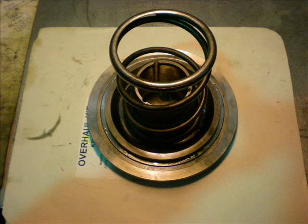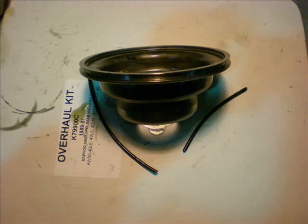Unfortunately, moveable cone seals cannot be replaced as the outer cup is seamed, so it is not detachable. Of course, you can try on a lathe to cut the outer cup through the rolling and open it. Then, after replacing the seal, press it back.